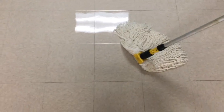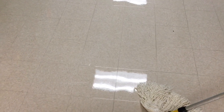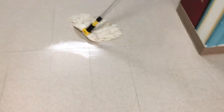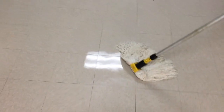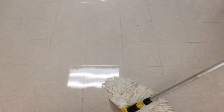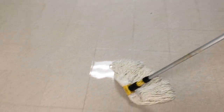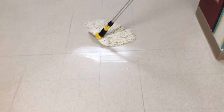If you ever strip a floor that has a buildup on it, and you have places where it's thick, where you've overlapped, you'll learn not to do that. You'll learn how to fix and correct that. If not, you'll be asking questions. Man, I got some wax down here I absolutely cannot get off the floor. It's so thick, so gummy. Well, it's because there's a buildup, and you don't want that to happen. Now, this building right here is 6 years old.